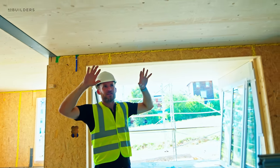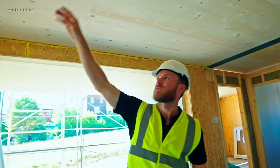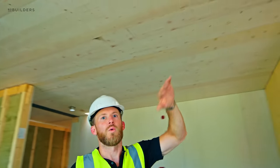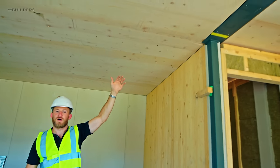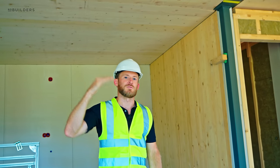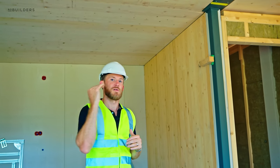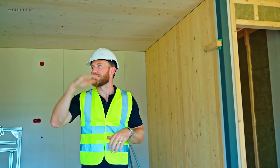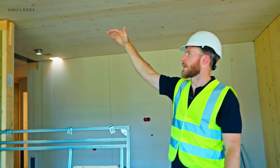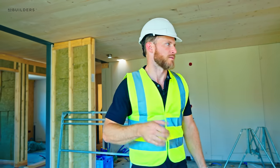An interesting detail that I've noticed in all of these projects with the CLT is that you're supporting all of it on the bottom flange of that steel, and the steel is always protruding higher than the CLT on the top. Why that is: since they're building up that floor system so much between soundproofing, concrete slab, and finished material, they can graze by that steel. And down here, it gives them a nice flat surface to run all their utilities. So if they have something high up, they're not having to jog around the steel up here. It's much easier to do that in a built-up floor system.